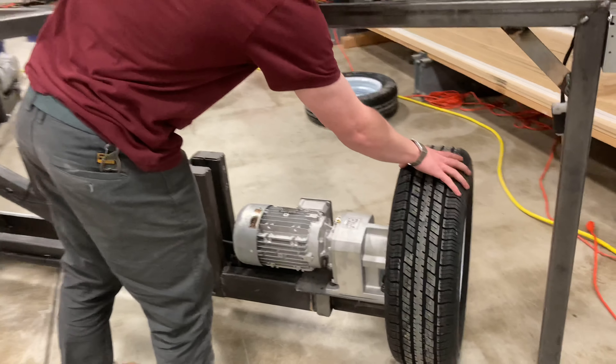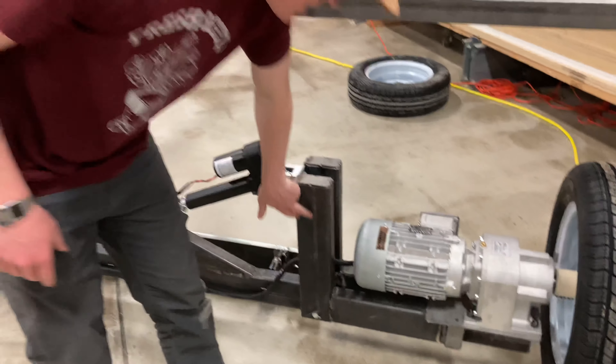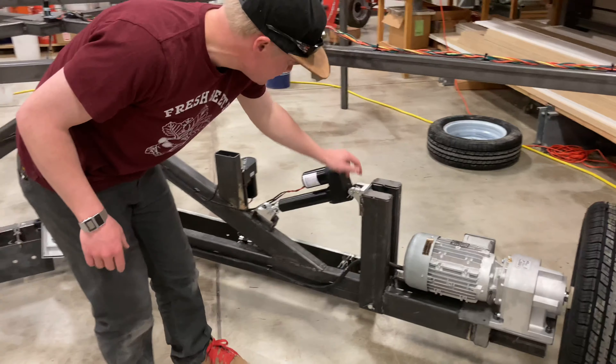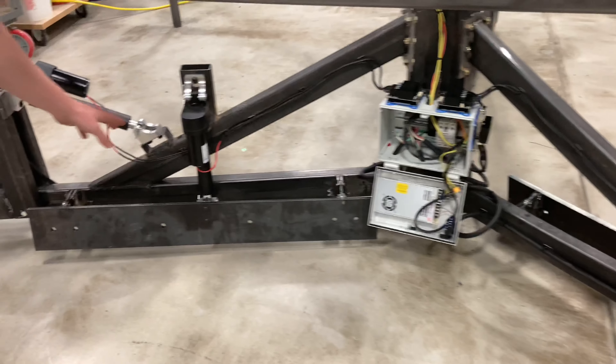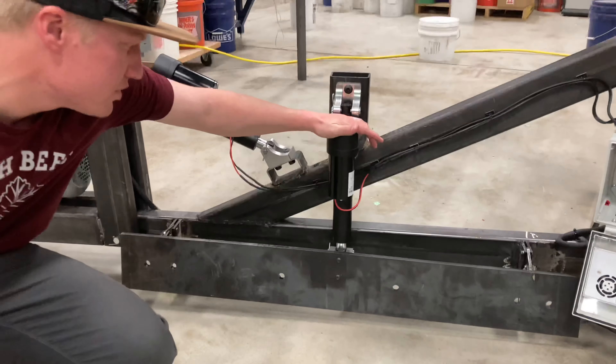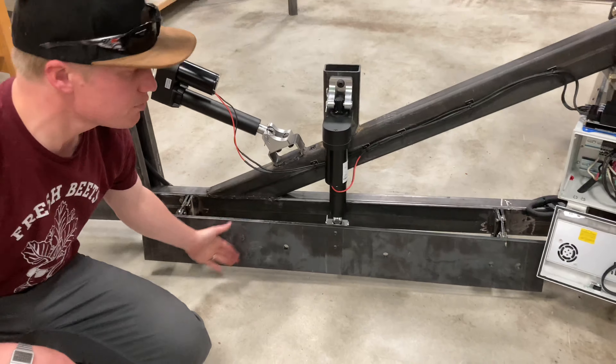You'll see that we've got the wheel mounted on a hub to our geared motor. Our geared motor is mounted to this L-frame that can hinge on this actuator. Moving in from that actuator, you can see on this side we have the blade actuators. We've got parallel linkages here on the side to drive the blade mounting point up and down.